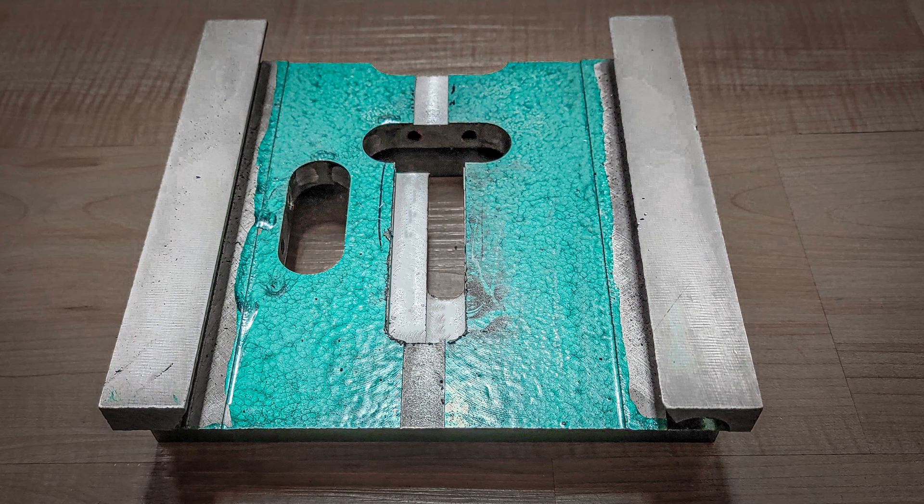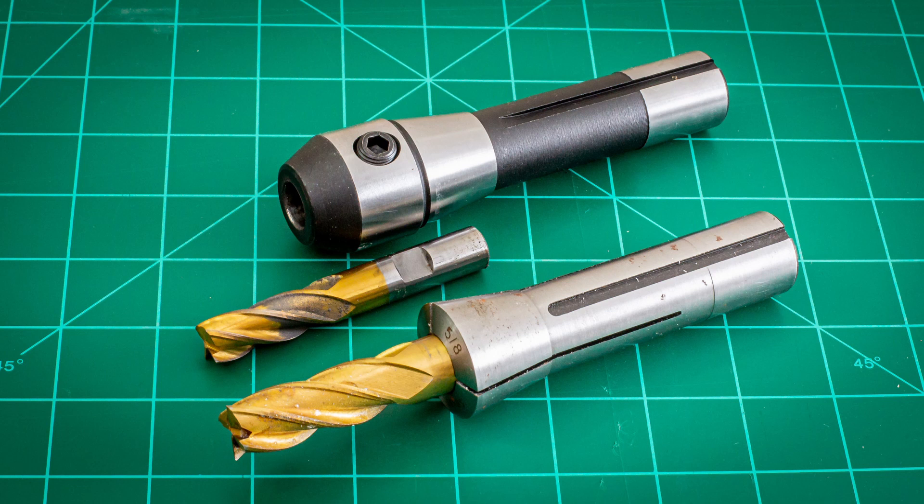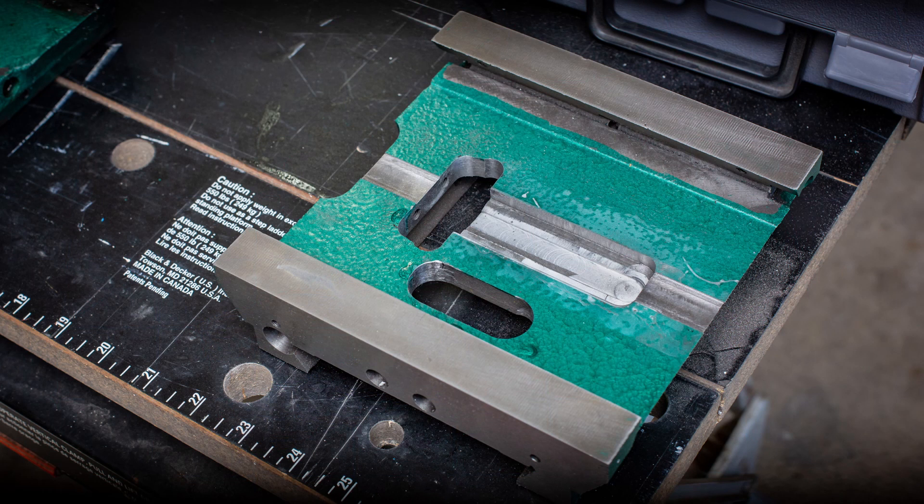Since I've owned this mill I only ever milled aluminum on it — this is the first time that I've ever milled cast iron. What happened was the end mill was slipping in the collet and it pulled itself deeper and deeper into the work as I was milling the slot. Apparently it's not an uncommon problem and the solution is to use an end mill holder instead of a collet. Here you can see an end mill holder on the top compared to a collet on the bottom. The end mill holder has got a set screw that locks the end mill firmly in place — another lesson learned. So after that mishap, in addition to getting a set of end mill holders I also bought yet another saddle to replace the damaged one, and that's how I come to have three saddles for my mill.